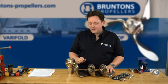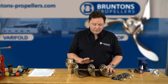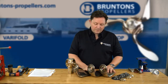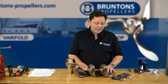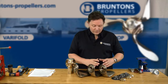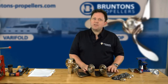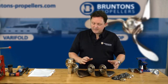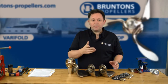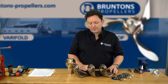We had a little go with that. We had a wire brush on a rotary grinder — that worked very, very well. We also used 180 grit, 200 grit sandpaper and that was quite intensive but worked very well. The best one we had was 100 grit on an orbital sander, one of the little mini ones. We just buffed the blade very, very nicely — it brought it up, left it with a matte finish. Then once we had the blade and all the hub done, we put a rotary wire wheel on the bench grinder and that just buffed it up beautifully. And that's where we ended up.